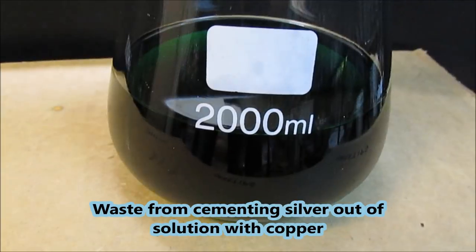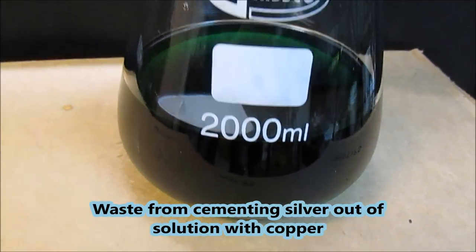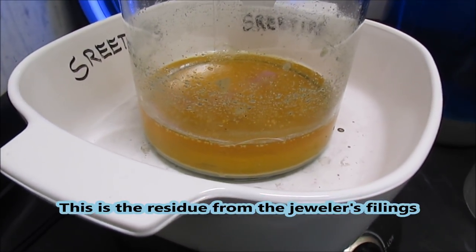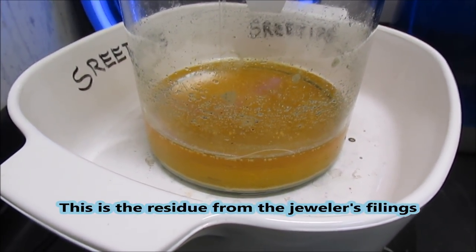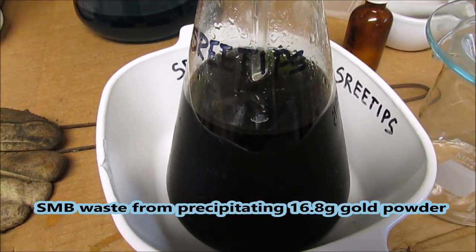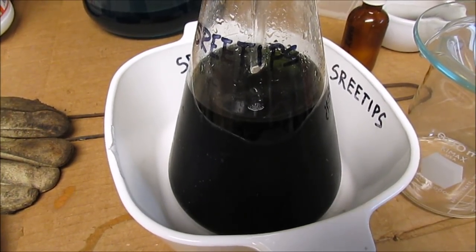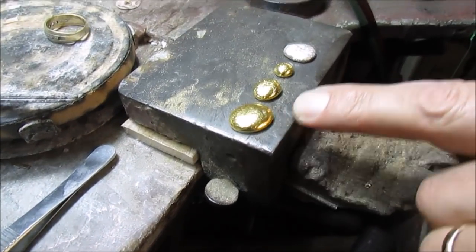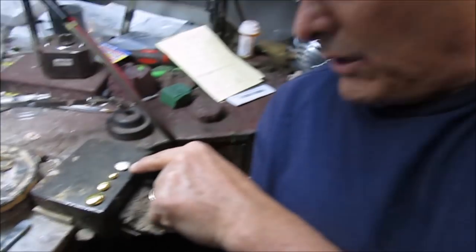This is the silver waste — I'll add that to a separate container, not my stock pot. I put it in a separate container and put copper in it to cement out any remaining silver. Over here I have the filings with a little bit of platinum solution on top — not enough to refine. I'll filter that out, rinse the filings well, and add that to my stock pot. We've completed the jeweler's sweeps. We got the 16.8 gram button from the filings, a 9 gram button, and a 4 gram button. This is everything that came out of all the jeweler's waste including the silver button. That concludes our video on the jeweler's polishing sweeps. Thanks for watching.